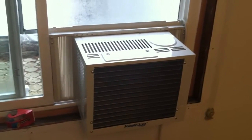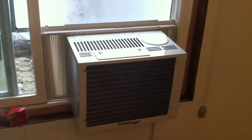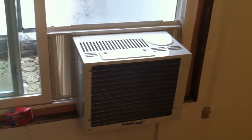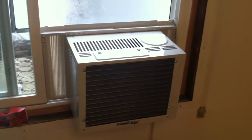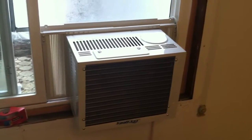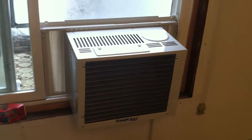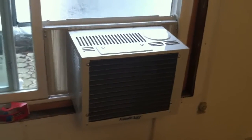But once I did that, when I turned on the air conditioner and it was reasonably warm outside, you could actually feel warm air coming out of the back. It would raise the temperature by about maybe 15 degrees or so. So if you started out at like 65 degrees, you might get maybe 85 or even 90 degrees out the back, which is fairly remarkable.